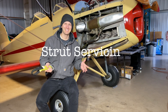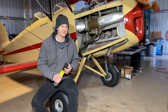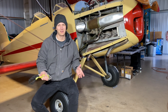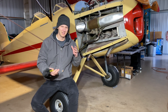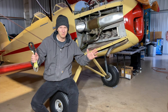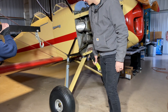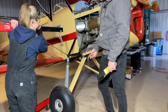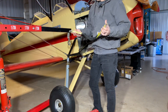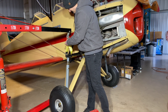We need to service the landing gear strut. It basically works like an oleo strut with 5606 fluid and a spring in the bottom. The packing should not be leaking, so we're going to lift it up, fill it with fluid, and put it back down — kind of a waiting game, but there have never been any puddles under it before. One of the weird things is you can't just jack the plane up — you have to lift it. This part of the structure is where we wrap our strap around. We've never done this before, so hopefully it works.